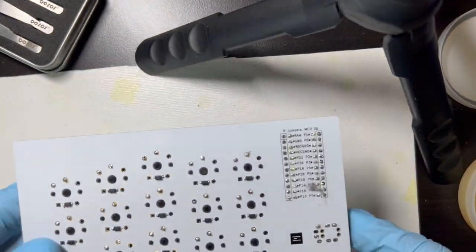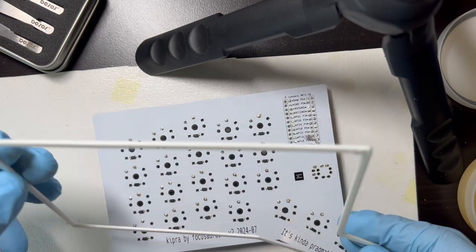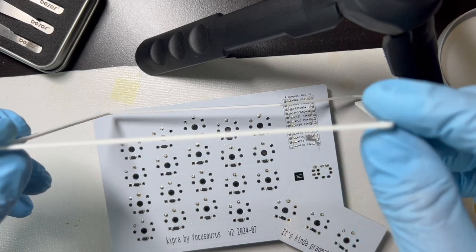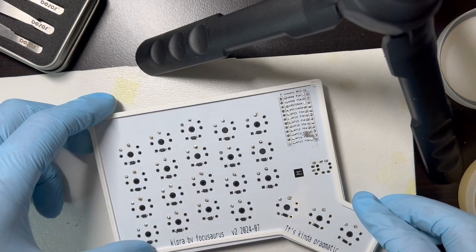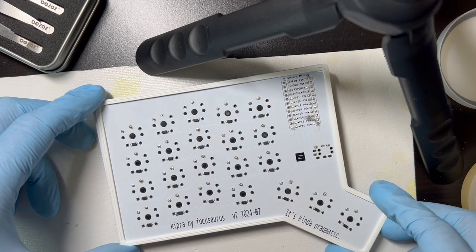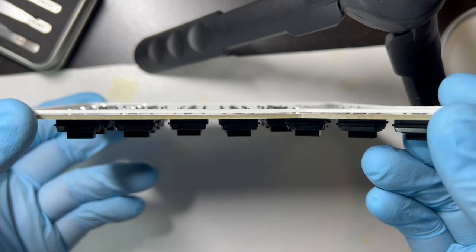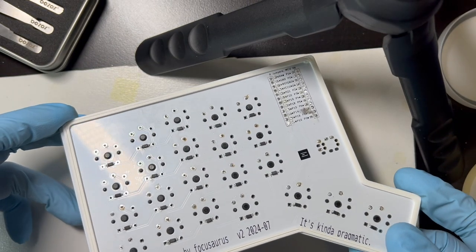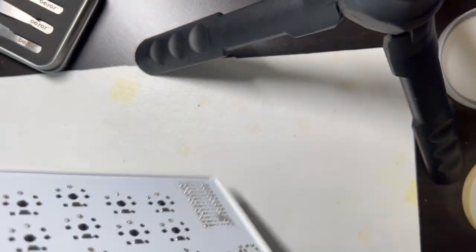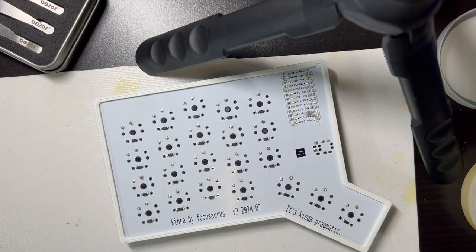is I put a bottom plate here, which is just 3D printed. It's really thin. I forget the exact dimensions. I think it's less than 2 millimeters. But that just sits here, and its purpose is to support the perimeter. And ideally, it's just barely tall enough to clear all the components, and keep it as low profile as possible, but keep anything from scratching the desk. But then I also need something to keep it from sliding and to provide a little bit of shielding.